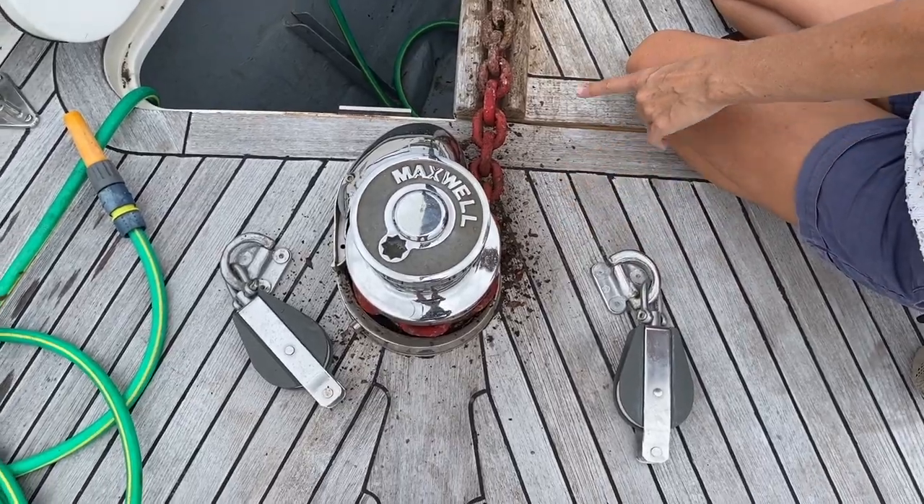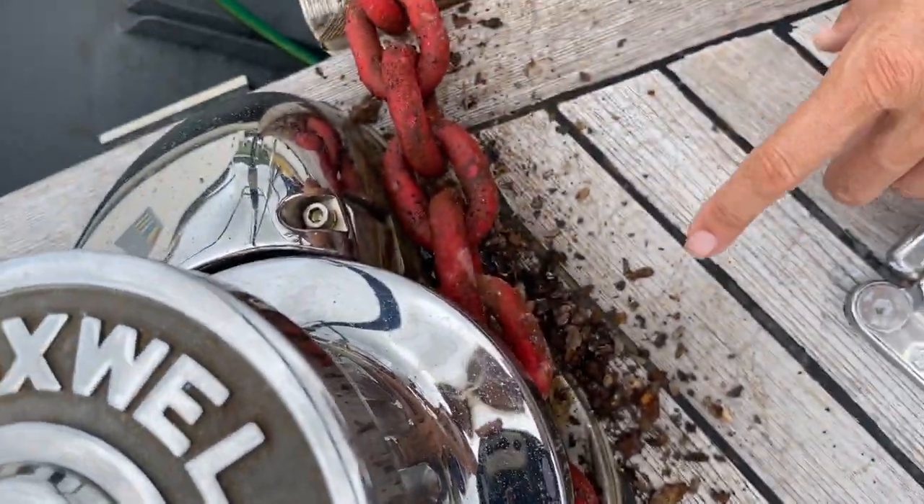When do you know it's time to change your anchor chain? We noticed it was time when there were shards of chain just being left on the deck, things were starting to get a little bit thin, and my wife Kim was getting worried and not sleeping at night asking me to go and check the chain. For years we'd rotated the end of our chain — the end that's in the water becomes the end on the boat, and the end by the bitter end goes out into the water. That prolongs the life of your chain because the chain by the anchor runs around on the seabed and that's where it starts to wear away.